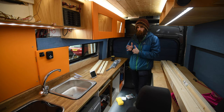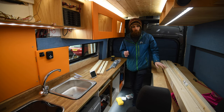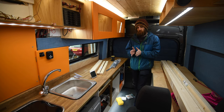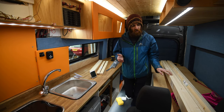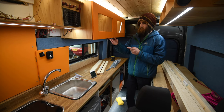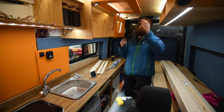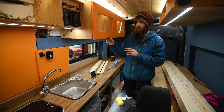The bottom doors will have rails and stiles and then a wooden insert. I'm going to be using 18mm by 70mm wood and then a 5mm plywood central panel, which should be reasonably light. I went for the 18mm — I couldn't find 15mm — but it's deep enough to use normal cupboard door hinges. The upper ones have a different style of hinge and I've put some gas struts on, which are quite cheap and work well.